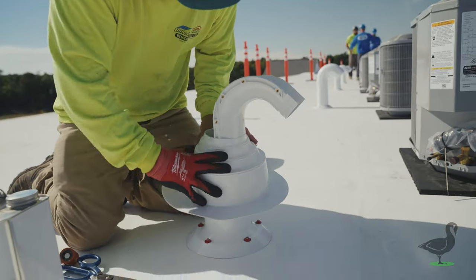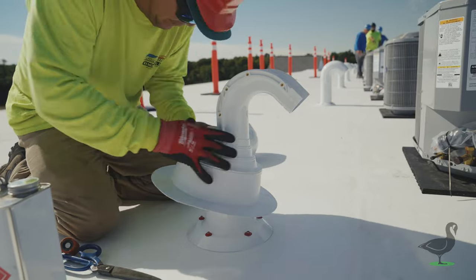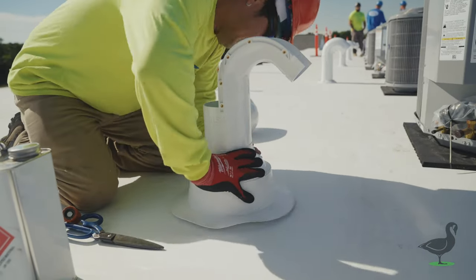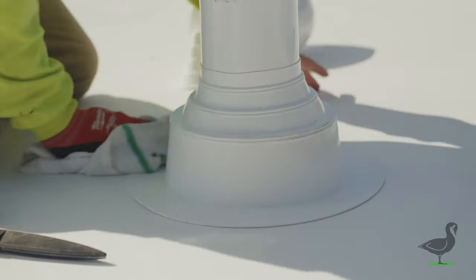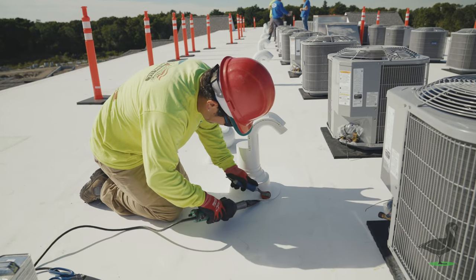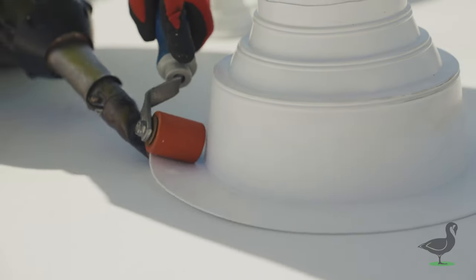You might find it beneficial to warm the top of the flashing once it's cut before sliding it over, so the material is as flexible as possible. It's best practice to follow the appropriate flashing detail outlined by the manufacturer of your roof.